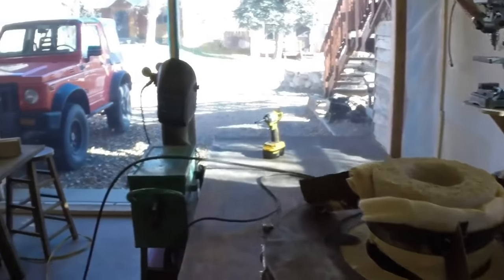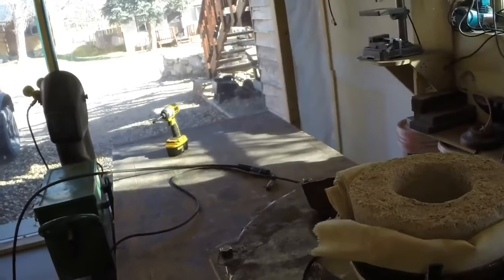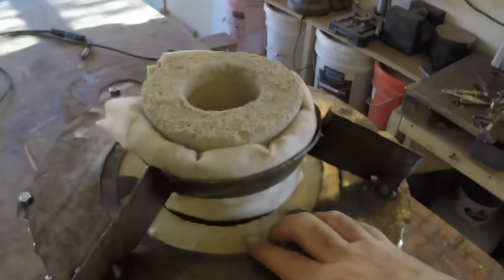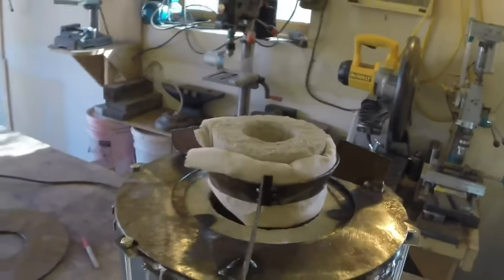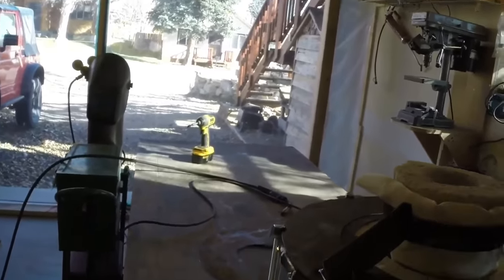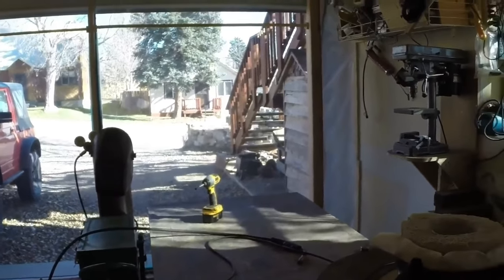All right, so what I like about it is that it holds that piece of refractory, keeping in mind that this is the wool blanket, right? The wool blanket will come in here. Just move it over a little bit. So the wool blanket will be up in here, and then the wool blanket will be exposed to the heat. Like so, maybe you can see. So the wool blanket will be down in this area, and then it will wrap all the way up around it in here and hold this piece in place. And then the rest of it's insulating wool and some sort of structure around here to make this donut relatively sturdy. It doesn't have to be hugely sturdy, but if it's going to be picked up and swung, I'd like to have a hinge somewhere here so I can pick it up and swing it. I've seen that on the internet. It's not my design, but it looks like a good design. It needs to be somewhat structural. Anyway, okay.